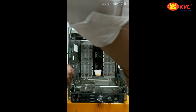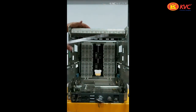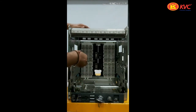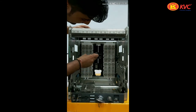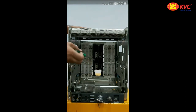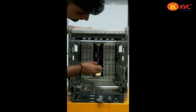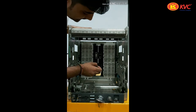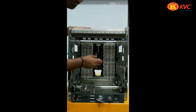This is the cradle of the UPOWER-Omega ACB. This is the telescopic channel on which the air circuit breaker rests. This is known as the safety shutter — it is called a safety shutter because when the breaker terminal enters, it prevents sparks from coming inside. These are known as jaw contacts, which are used for proper termination between the air circuit breaker and the bus bar.